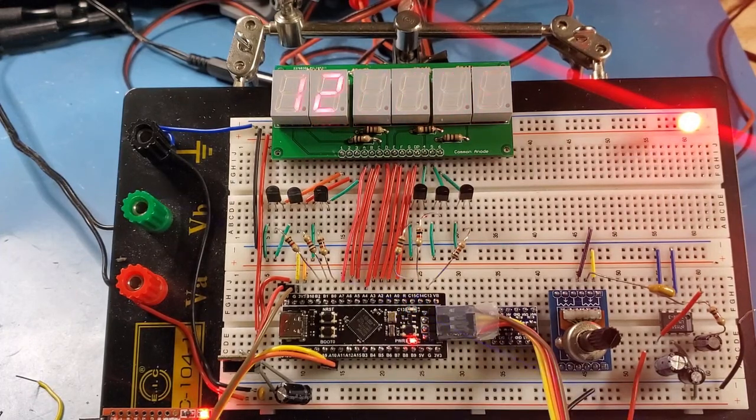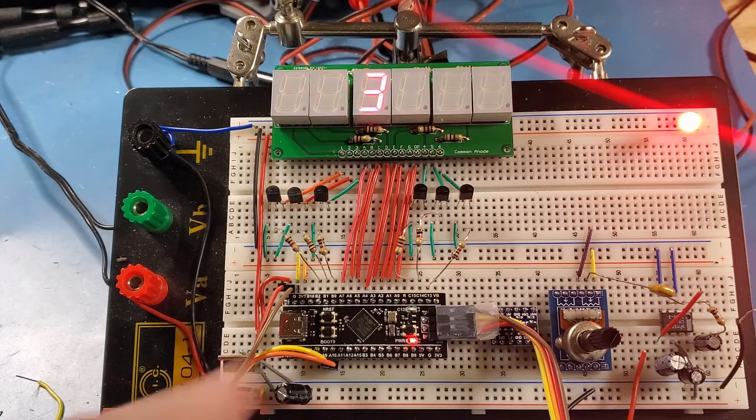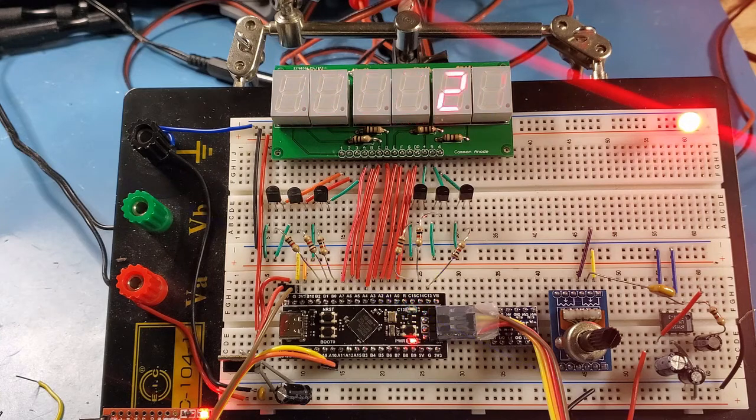For my next video I'll pull together a simple GPS disciplined alarm clock using the STM32F4 as microcontroller, and you can see I've started to build it up here. Features I'm thinking of include 12 and 24 hour display, GPS corrected or GPS driven time — the GPS protocol does come with UTC time which I would need to convert to local time — and periodic longitude and latitude display. Obviously the alarm as well; not sure whether I'll use a sound device or just PWM from the microcontroller.